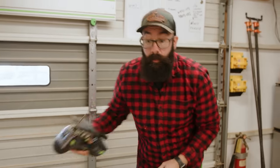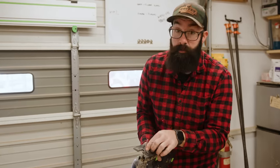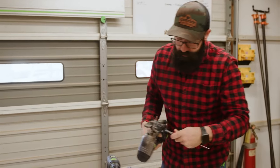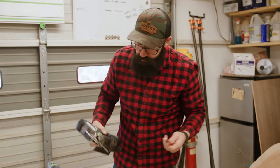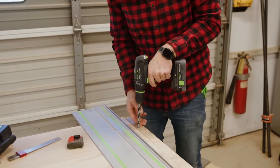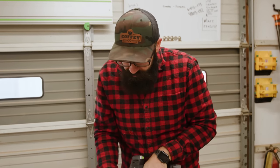I did want to mention that you want to make sure your jigsaw blade is centered on the actual bed. It is not on this saw — it's this distance on one side and a different distance on the other, so it's not exactly centered. You need to make sure that you're cutting on the side that you just referenced against. Now I'm using a drill with a large bit so I can get as close to the line as possible without going over, to get my jigsaw blade in there to start cutting down this line.